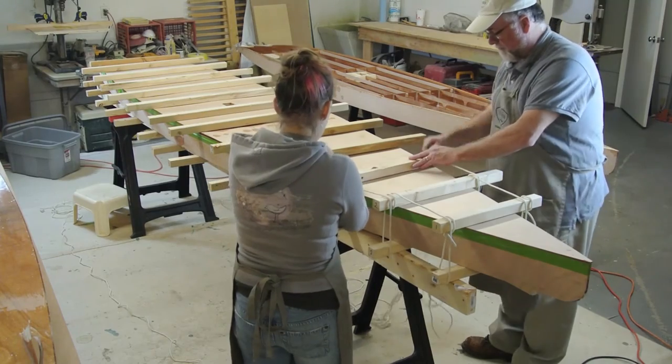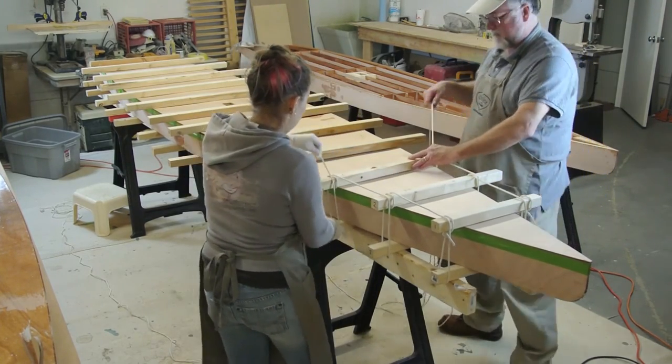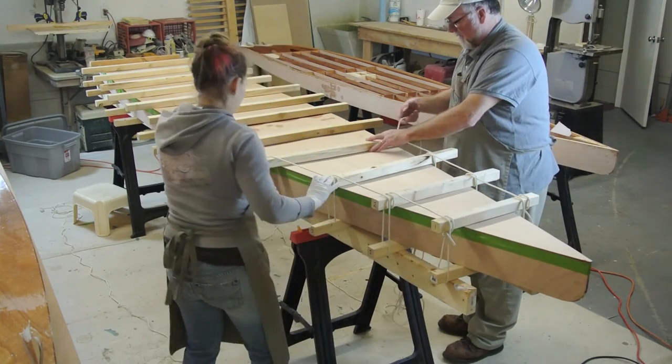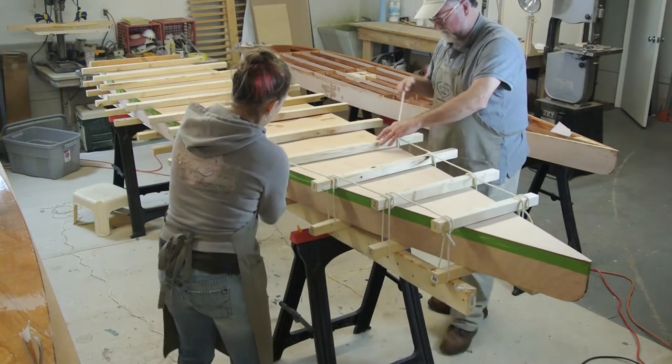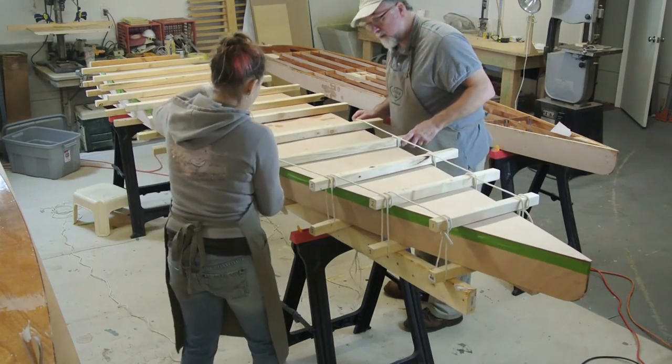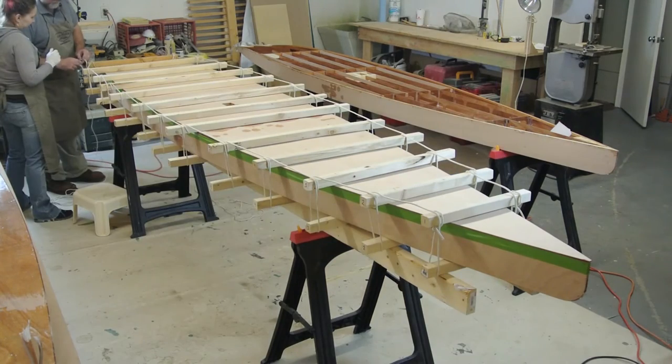Extend the rope to the second set of clamping boards and make another continuous loop. Keep walking down the side of the boat, completing loops around each set of clamping boards until you reach the transom. At each clamping board set, remember to do a continuous loop around the top board before you extend the rope to the next set. Tie the rope off to the last set of the clamping boards with a single knot.